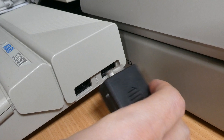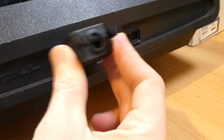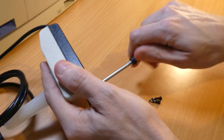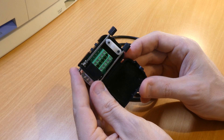I actually bought a 9-pin female breakout connector but due to the design of some of the machines I'm using here it wouldn't reliably plug into most of the sockets, so I'm going to have to cannibalise an old joystick for its cable. I had this broken Commodore joystick that I got in a box full of bits a while back so it seemed like an ideal donor. After disassembling the joystick and cleaning the cable I needed to confirm which wire went to which pin, so I used my multimeter.